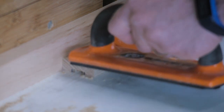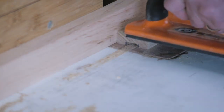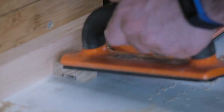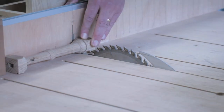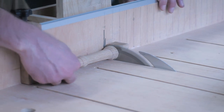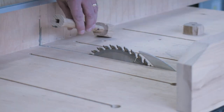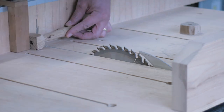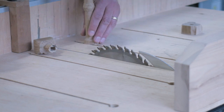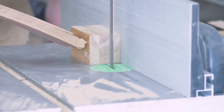This time I was a lot more careful before committing to cut the whole channel out. But once I had it really close down the center, I could just take it, chamfer it out, turn it around, and chamfer it on the other side for just that tiny bit of difference. This is where keeping those ends squared keeps the handle centered. Now that we have the chamfer cut out and the center cut out so it's oval, we take this and cut the actual handle out. The first cut is pretty straightforward and fairly safe. The next cut is a little tricky — I would have preferred to make the handle a little longer, but to keep my fingers away, I cut not quite as close to the edge as I might have.